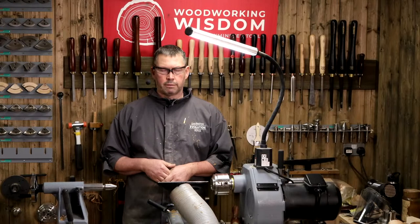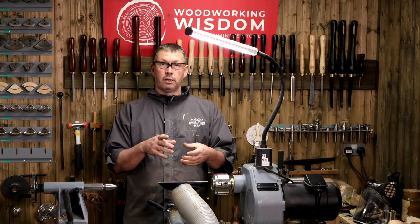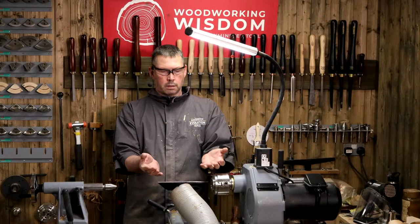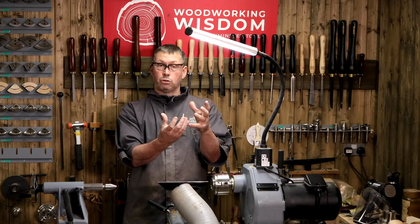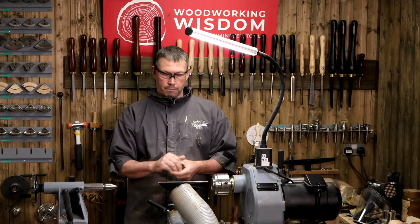There's a fantastic Irish turner called Joe Laird. He makes whiskey tumblers, and he does it in the old way, same way you would make a wooden oak cask. So he uses oak. And you said the other day, Ben, about pinch pots. What he does, he turns the outside of the oak flask all the way through, and then uses the grain orientation going the other way, plugs it, lets the piece shrink around it, and then actually fires the inside of that tumbler to make it waterproof or whiskey proof. So in the old fashioned way, the way you do whiskey casks, that works really well.